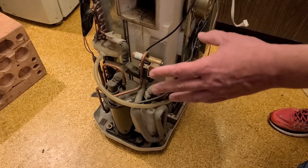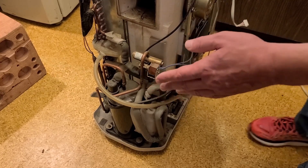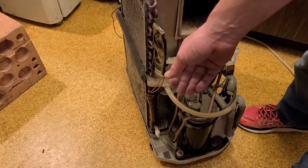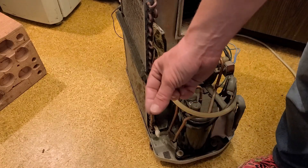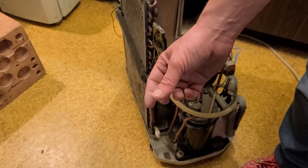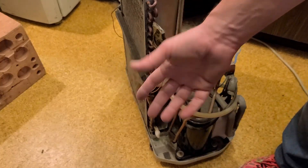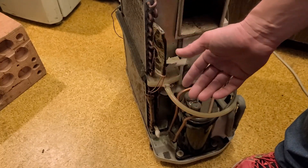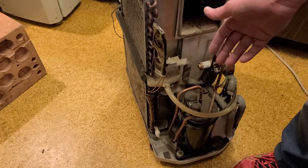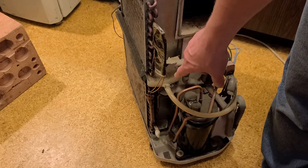Even the tiniest amount of water vapor in an air conditioning system can really screw it up because of something known as the expansion valve. It's a restriction that the compressed refrigerant goes through, and as it passes through like a little nozzle, the expansion draws heat from the air in order to boil the refrigerant — and that's what causes the cooling action. We can see we actually have trays for both sides for draining because it reverses, so you need separate trays.